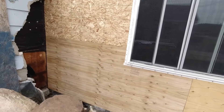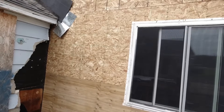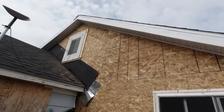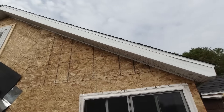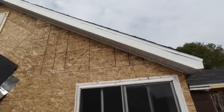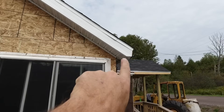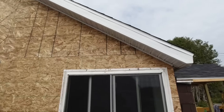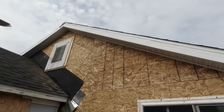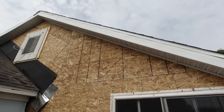The whole wall is all brand new — it's got treated plywood on there and OSB. So treated plywood four feet up and then OSB all the way up. I was able to get the overhang all done; I had some helpers come last night and we got this all finished up. I still have to trim the very edge right here, but the eve coverings, fascia, and everything's on there.